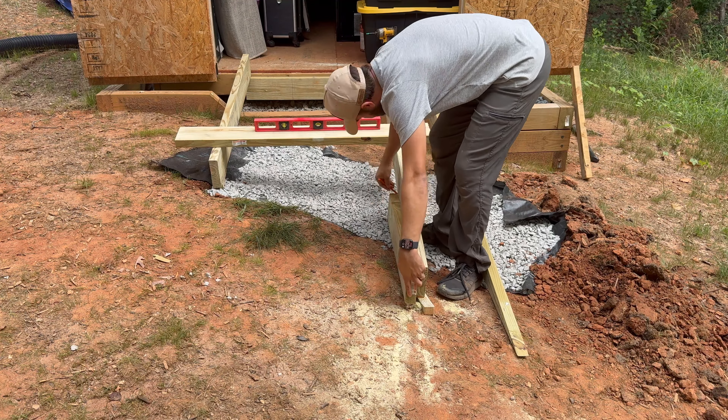On my last row I needed to rip a piece of 2x6 — depending on how you lay this out, you may not need to do so. I laid a piece of 2x6 across the beginning of the ramp, as a full piece there provides better support for the angle cuts we're about to make. To make sure the angle cuts have full support when sitting on the ramp, I added blocking across the whole ramp.